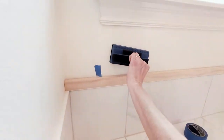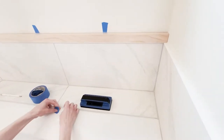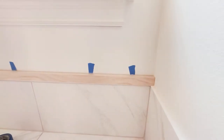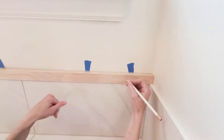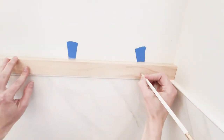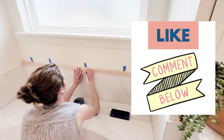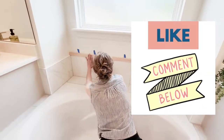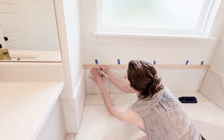I'm going to take a moment and find all the studs on the wall. This will help me mark my stud points on the board so I can drill everything correctly. My peg rail is not going to carry significant weight, so I determined that two holes for the studs was adequate. I didn't want to do a center one because I have a center peg.